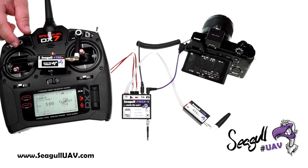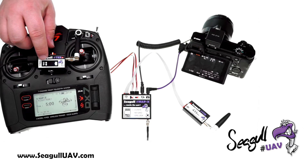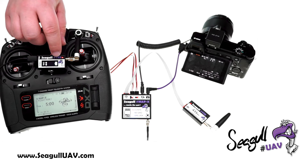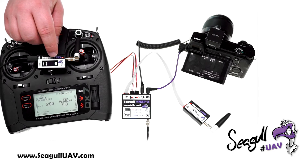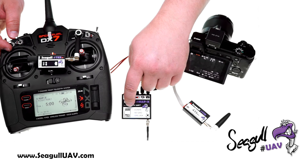Now we are ready to start a mission. On the mission screen we have a 'C' for confirmed photo count and an 'F' for failed photo count. There is a small camera symbol showing the current trigger mode, and a small animation when the camera is actually triggering. When triggering a photo with ACT mode — our autofocus custom trigger — you can define the pre-autofocus time in the config file on the MAP-X SD card.